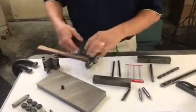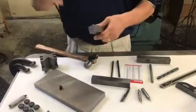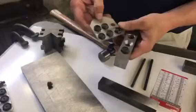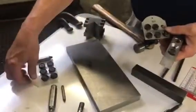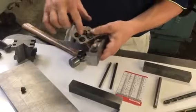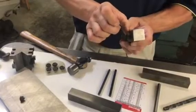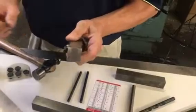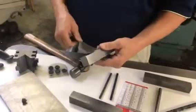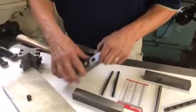That's one kind of spotting screw. If you've got a plate with four tapped holes that don't go all the way through, these sets usually have six spot transfer screws. This is a half-13; they've got them in most any size — quarter-20, five-eighths-11, all different screw sizes. You put four screws in the holes, set the piece down, and these are precisely made so the thickness from the bottom of the head to the point is all the same. So you don't have to worry about the thing rocking. Screw it down tight and give a good blow to transfer the hole locations.